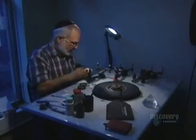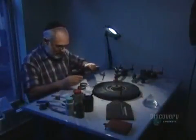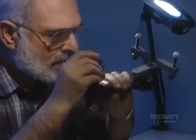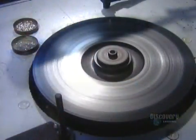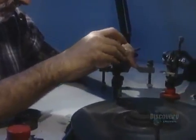The second stage of diamond cutting is called polishing. It's the process of forming the diamond. A special machine first tailors the basic shape. Then the diamond cutter puts glue in a mounting tool called a dop. This will hold the diamond firmly in place. He presses the diamond against a spinning cast iron wheel, coated with a mixture of diamond dust and oil.